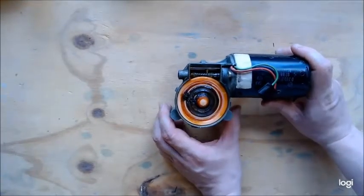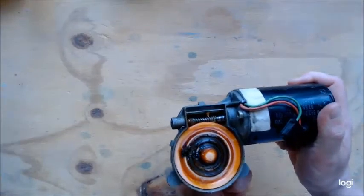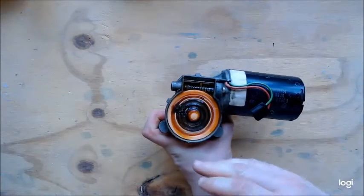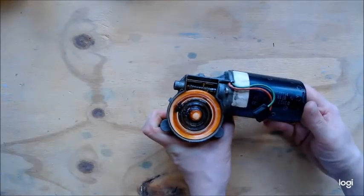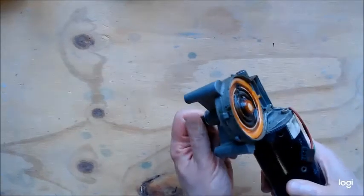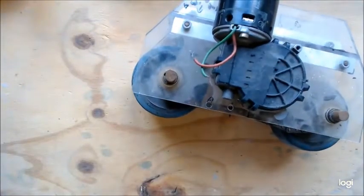This is a very geared-down motor. As part of that, you can't back-drive it — if I wanted to drive the motor by turning the shaft, I can't. This is a downside because if you use this to drive an R2 and you break down, you're left carrying your R2 or waiting for someone with a trolley. This was the first drive system I built, but I sort of never used it because subsequent drive systems came out afterwards.